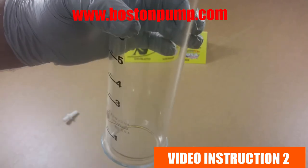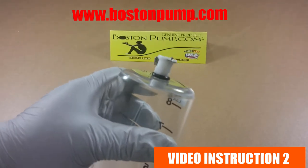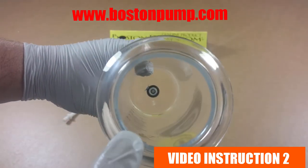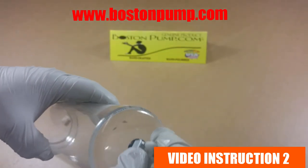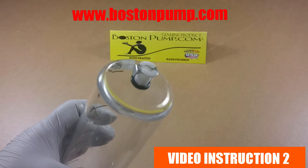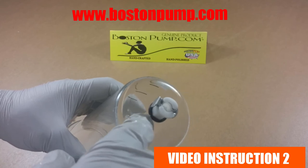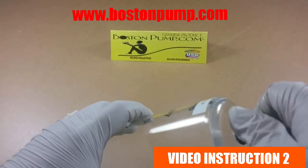This is how the cylinder should look when you receive it: the coupling is sitting nice and tight, not over-tightened. The o-ring is seated very nicely, completely attached to the top part of the coupling. Looking inside the cylinder you can see the trace of attachment to the acrylic. If you over-tighten — as many of you do — the coupling gets squeezed out and that can cause cracks on the top. Not only that, you can get a leak because the o-ring displaces itself from the pressure caused by over-tightening.